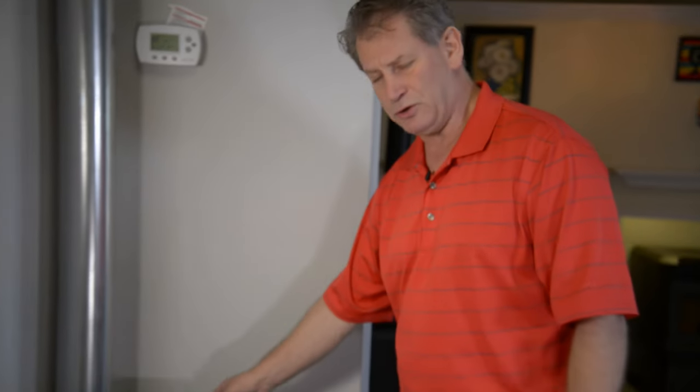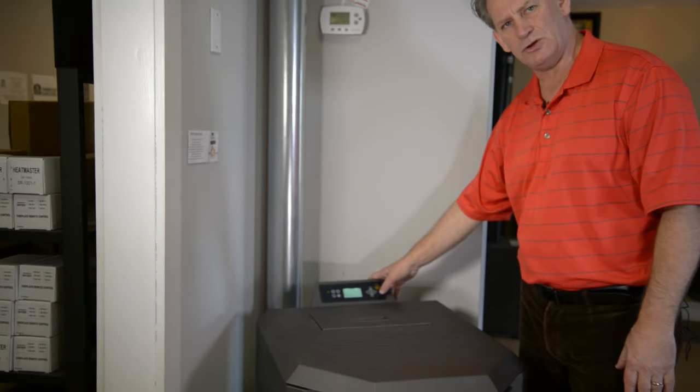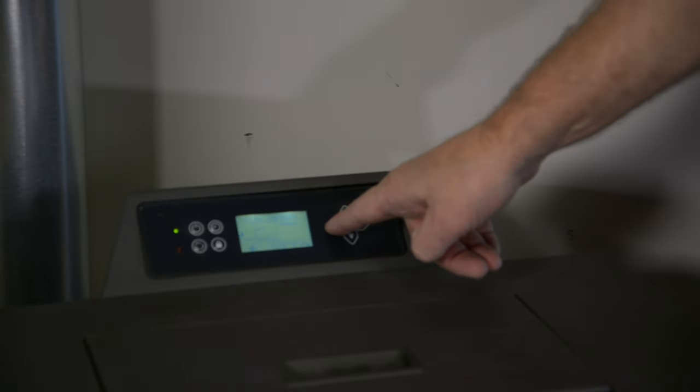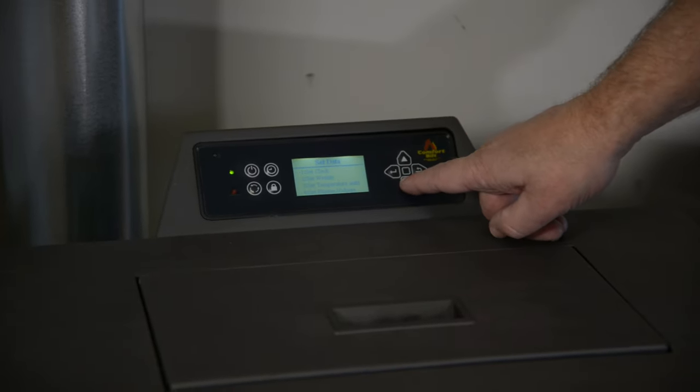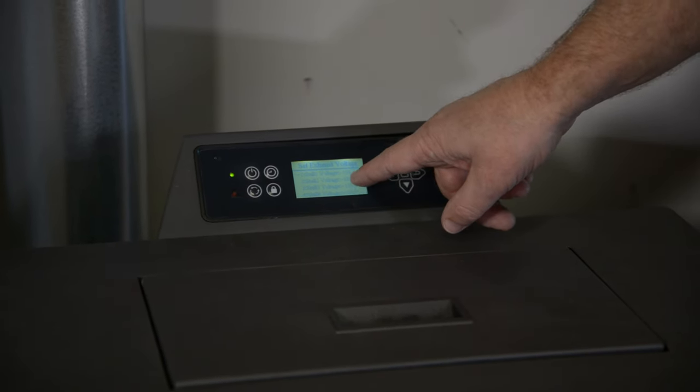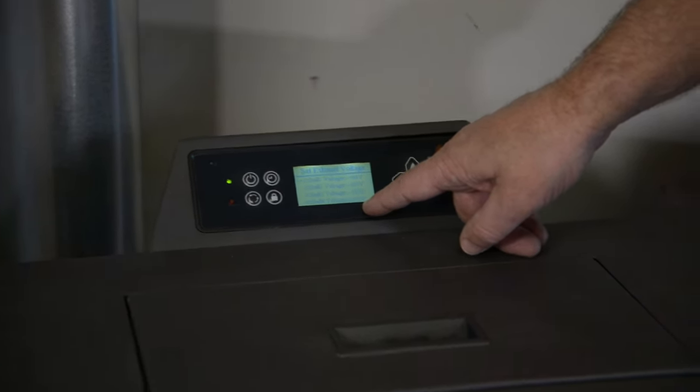If you have placed your TV close to the stove, you can barely hear the blower noise, but you do have the ability to lower and increase your blower voltages. By simply depressing the left arrow, you can come down to number four blower voltage and hit your left arrow. That will allow you to change your voltages on your blower assembly.